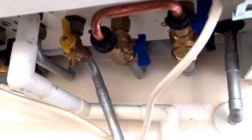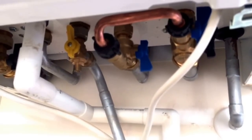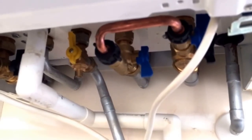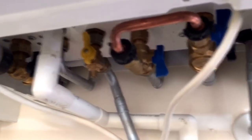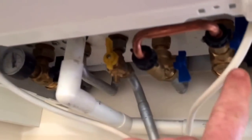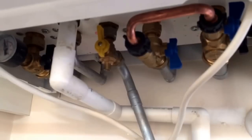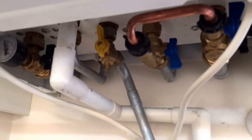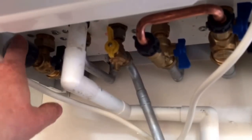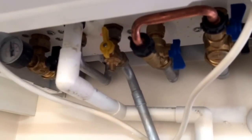At times you may need to do that top-up. You may find that when you go to turn the tap on, the hot water has physically gone off. Come and check that pressure — you'll probably find it's gone down to zero. Top up and you should be good to go again. Also, if you go around and vent the radiators, you're letting air out of the system and also allowing the pressure to go down. So whenever you vent your radiators, you'll just need to come and top back up here at the boiler.